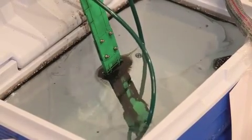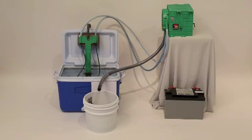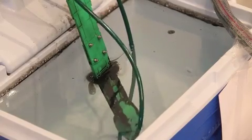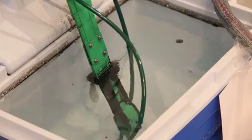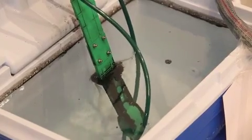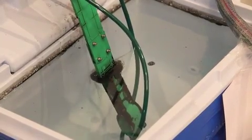So you can see now after 30 minutes and all that oil poured in, all that's left around the sides is a pretty minimal amount. And at the 40-minute mark, you can see that there's basically not a lot coming out of the spout at all. We'll just go to a close-up now and see what's left in the bath. Very, very efficient way of getting rid of that horrible oily water. Look how clear the water is. Basically, considering what we had was a massive mess — or potentially a huge fine if it had been pumped over the side — now you're dealing with next to nothing, and you've got a whole bucket full of oil.